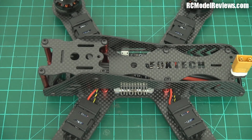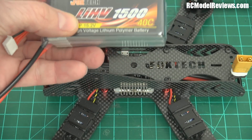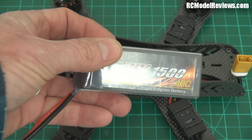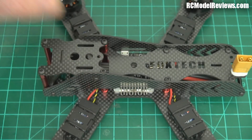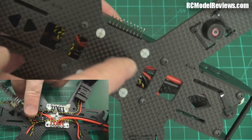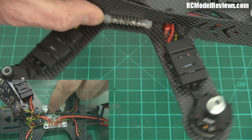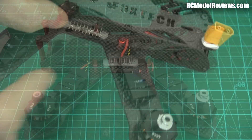The camera is a 12-volt camera, and they've sent one of their high-voltage 1500 four-cell batteries — these are nominally 15.2 volts, and when fully charged they're close to 17 volts. So you can't run your video camera directly off this battery because the smoke will come out. What they've got on this PDB is a 5-volt and 12-volt BEC, so you can run the camera off the regulator on this board. This also provides voltage to run the flight controller and receiver, because these are opto ESCs with no regulators in the ESCs.